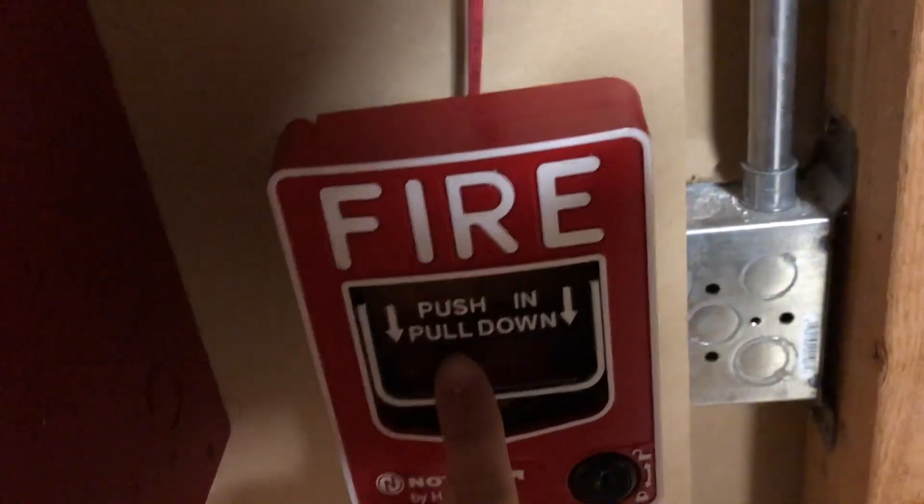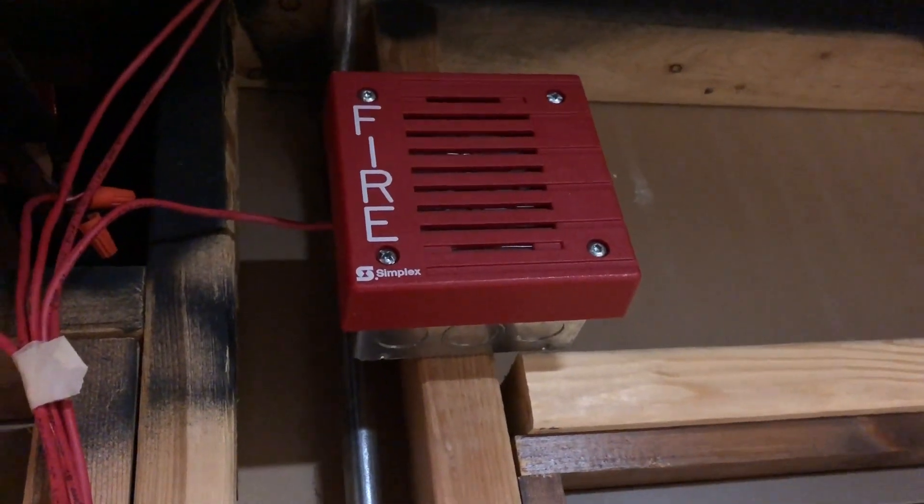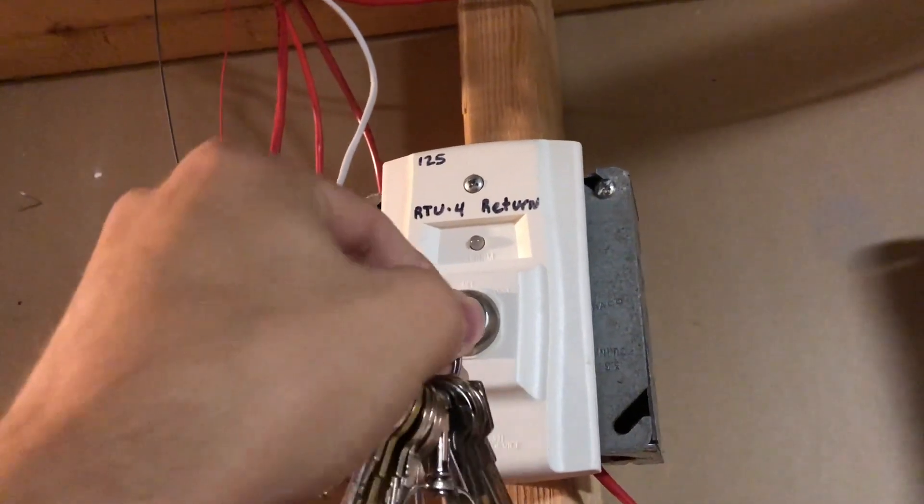The next are also set on zone two. The reason is it will allow me to quickly go into two-stage after kind of verifying an alarm. So if we smack a pull station here, that's its first stage. It'll do that for three minutes, but I can override it by hitting this, and we'll jump straight into second stage.